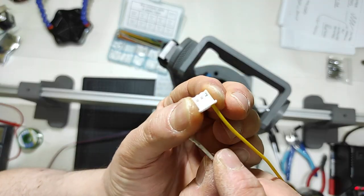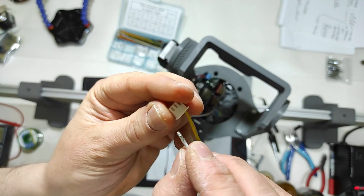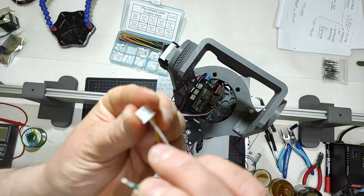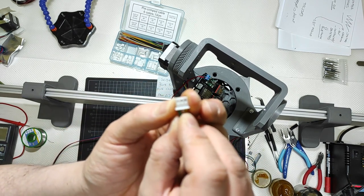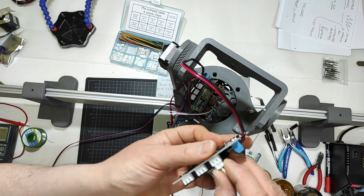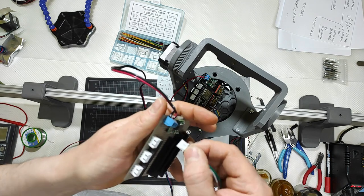I will go with the white one there, with the little protruding part, this little point here, that will go inside here until I hear a click. Click. Then I have the green one, same thing, the protruding one towards the hole that I have here, because the other side I don't have a hole, until I get a click. Click. Now I will test this on the prototype. It will go inside here and female and male will match like this one, and I can remove it by simply getting it out, and the wires will remain inside.